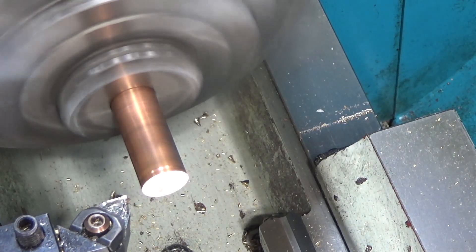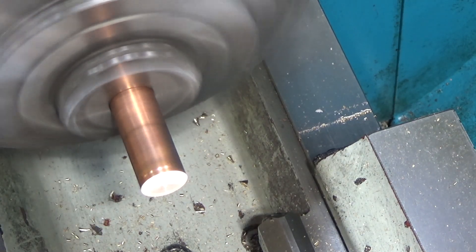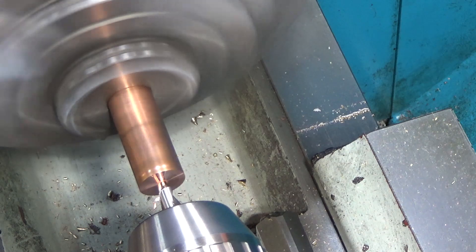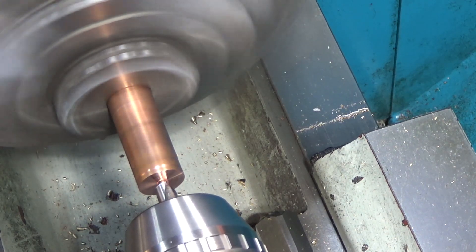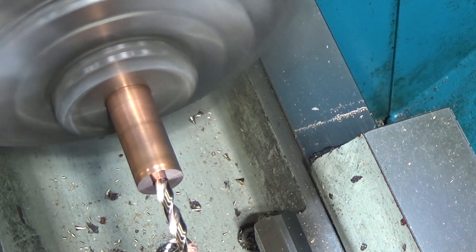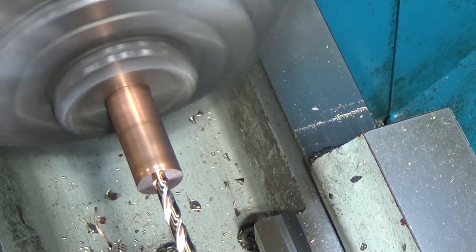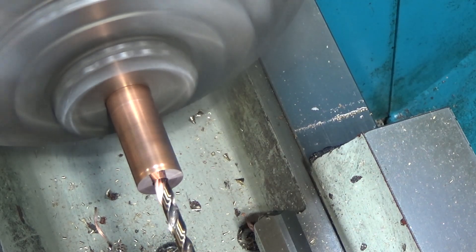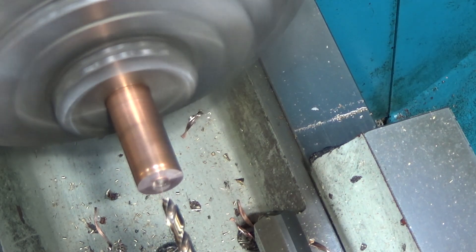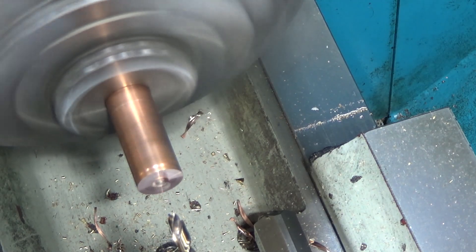There's my gauge. Got my copper bar loaded - I just want to clean up the face before I get going too far. I need to drill a hole down the center, so we're going to start with the center drill. Copper sure is gooey - I think of stainless steel as gooey but copper is on another level. I think copper work hardens too, which is why these chips are really deformable and then hard. Going to use the drill bit - whoa, okay, didn't expect that. It took my drill bit, sort of getting sticky in there, and I'm not using cutting fluid because I believe my cutting fluid is incompatible with copper.